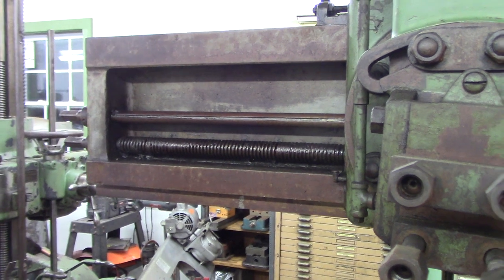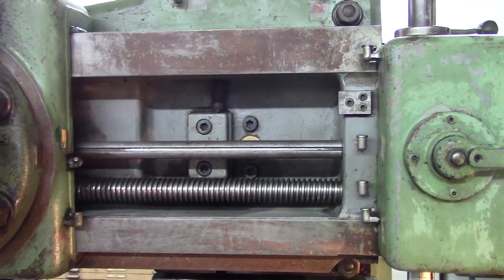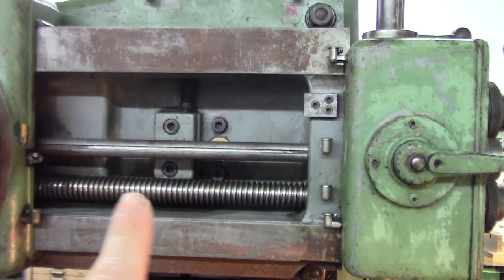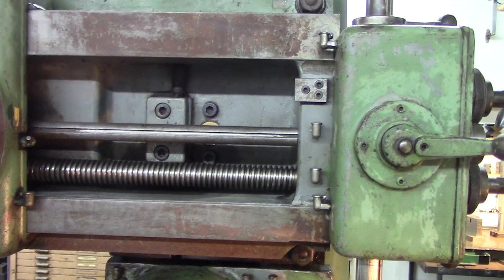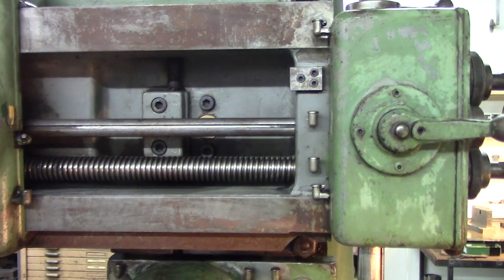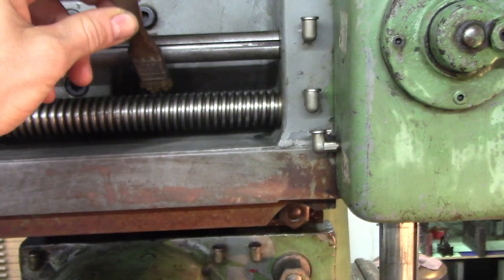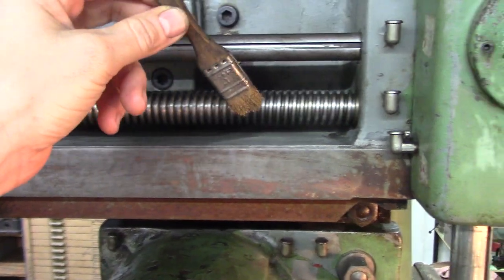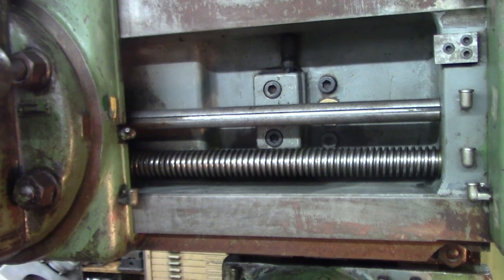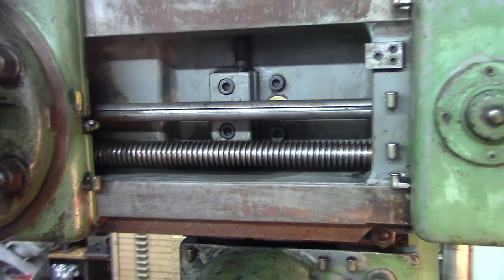See all the grease in the lead screw — this thing was very well preserved, but I didn't get to cleaning that yet. On this side you can see I'm down to the original gray paint. All this looks like rust — it's very fine surface rust, so fine I'm going to scrape it off with a razor blade. I put blue paper towels behind the lead screw and the shafts, and I've been using lacquer thinner on a brush. I just take the blue paper towels covered in grease and lacquer thinner and take them outside and burn them, basically incinerate them to nothing.